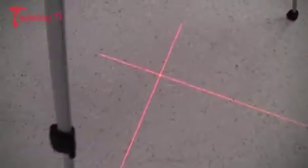The first thing you notice is that the point is actually a cross. The reason we've got this cross is to find the centre of the point, which is sometimes quite difficult. Looking at the ceiling, we've got a point in the middle connected to a light fitting. When laying out strip lighting in a room, you lay out the floor first and transfer your points to the ceiling. To make sure the strip lighting is lined up correctly, I can move it around using this cross to verify the orientation is correct, using other references in the room.